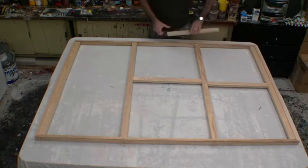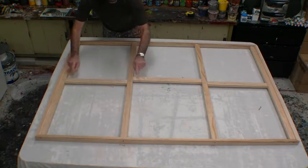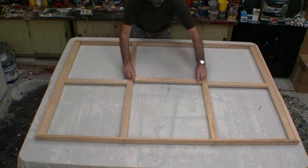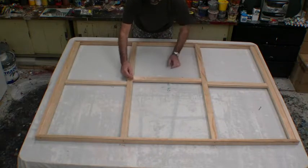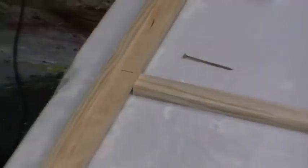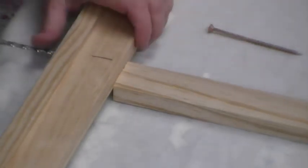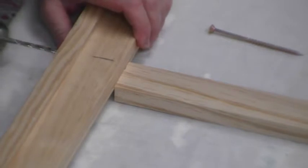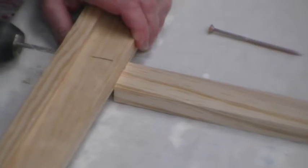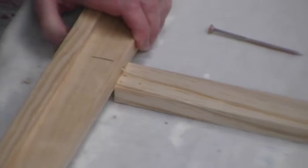We're going to have two of these timbers centered on the lines that you just drew. As you can see here, the center one will be offset so we just pull it back to give us room to get our drill and to screw in sideways. Now we have to screw these in position — as you can see at the end here we've got a very wide piece of timber because we've got the two together. So we've got to drill right through the two so we can come through in the center of the piece of timber — that's our pilot hole.